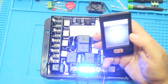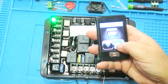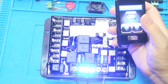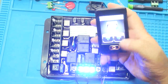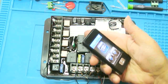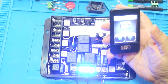The other channels operate differently. If we go to slide one, we're presented with two buttons — extend and retract. When you push and hold the extend button, the green LED comes on. As soon as you release the button, the green light goes off, and after a couple of seconds the blue external switch indicator lights return — restoring manual wall switch control. This confirms the system is momentary, not latching, for motor channels.